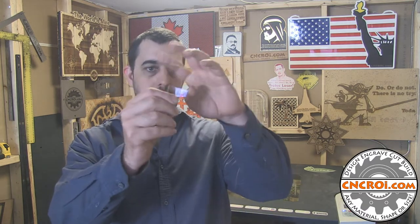Generally what we do with this is small medical parts, and because we have a fiber laser and a CO2 in the same machine, the CO2 can cut out the parts and the fiber can put specialized serial numbers on there permanently without the use of ink. So basically you end up with a very, very clear part with branding that never comes off.